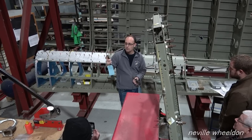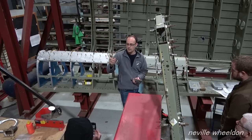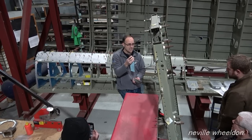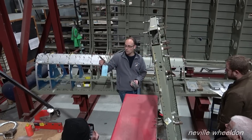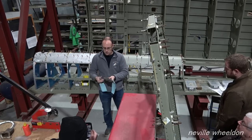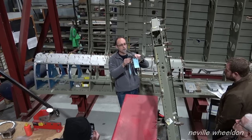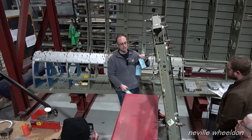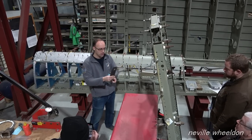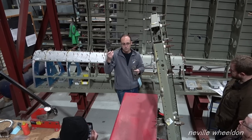Since this is just for taxiing, officially we don't have to find out what the material is, but luckily we have the drawing which dictates the original material. If it took 16 tons to take this out of this wing, it's going to take 16 tons to get it out of ours — so while we're making one for this wing, we might as well make one for NX611 as well. The bolt sits through a steel plate like this — through the plate, up through the spar, and into the rib. These steel plates are what are holding us up at the moment. You cannot currently get a modern equivalent to this original steel.